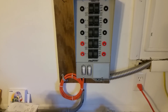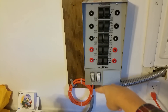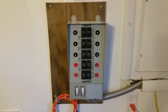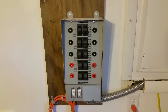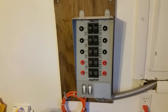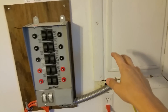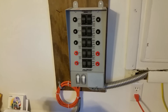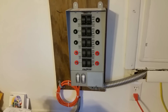One thing to be very clear on: a two-pole transfer switch only switches the hots — the hot leads from the L14-30 input and utility power. The neutral and ground are solidly connected to what's in the main panel. As a result, if your generator has its neutral bonded to the frame, during a fault condition the current can actually electrify the generator frame, creating a safety hazard. That's why when connecting a generator with a two-pole transfer switch, you must remove the neutral-to-ground bond at the generator so it stays bonded at the main panel, and fault current goes straight to your ground rod. The Tiger Claw 1500-watt sine wave inverter does not have its neutral bonded to ground, but it can have that bond added without any adverse effects.